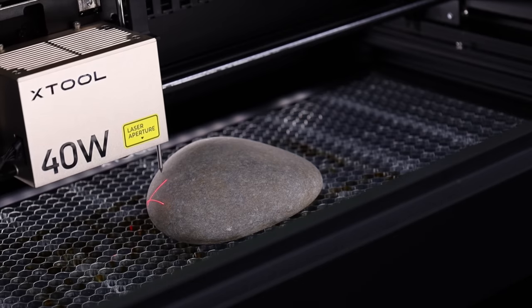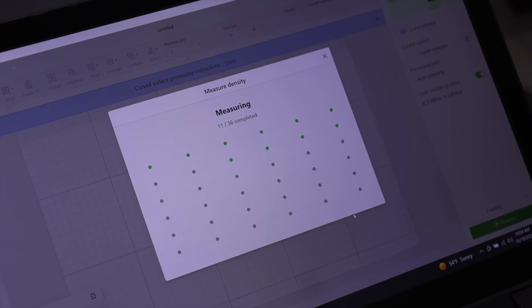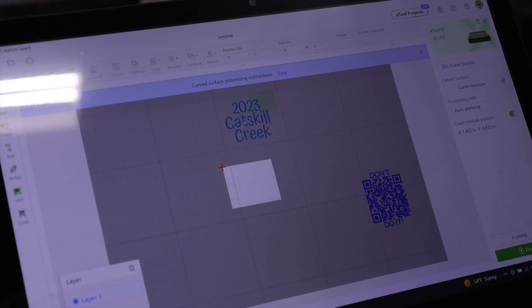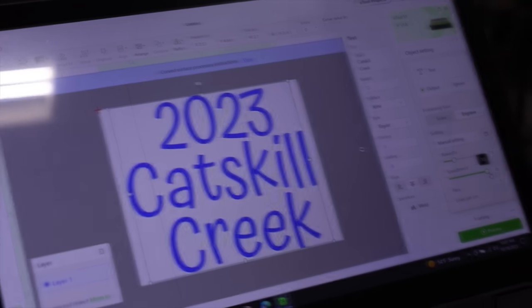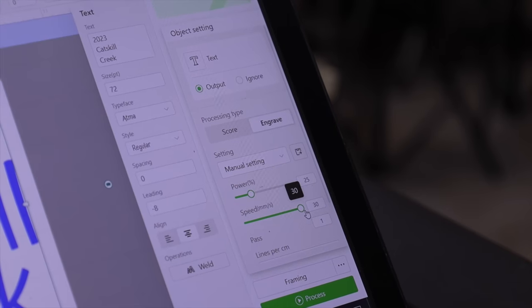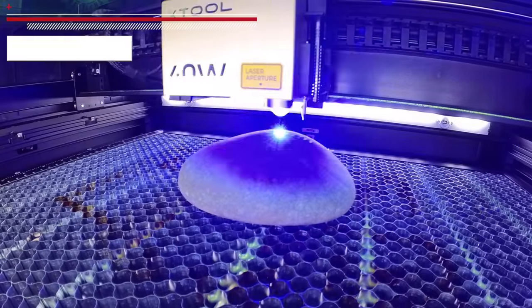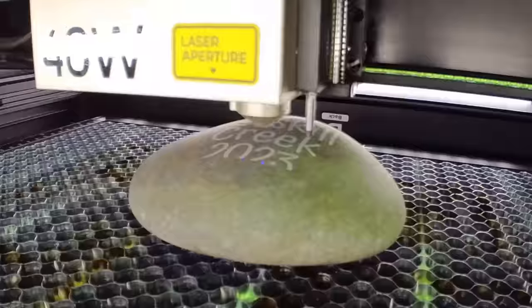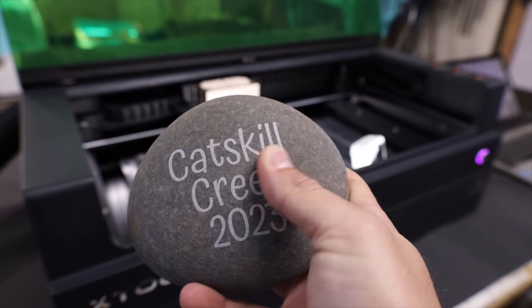It's going to go through and do all the measurements on the grid I've created on the computer. Here is the grid it's mapping out — you can make this as detailed as you need. After it's all mapped out, you can bring the design you want engraved down into that area. You are limited on speed: currently the max speed on the engraved is 30, which makes sense because it has to go up and down. So if my maximum speed is 30, I may need to bring it down to maybe 15%. That's pretty cool — it was able to maintain good focus all the way around with no variation in the lightness or darkness of the engraving.